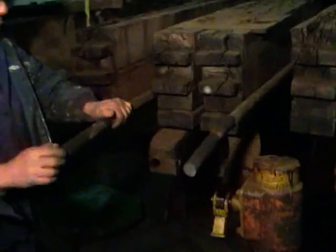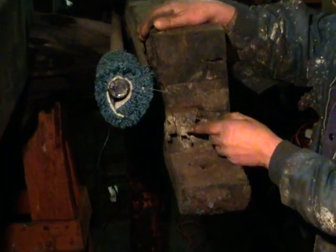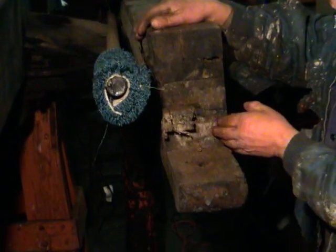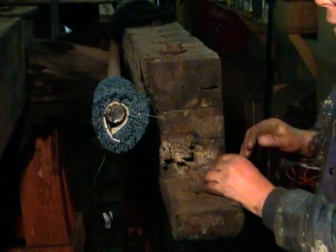These are the ends of the rods that the coupler fastened onto. Over here on this sill, we still have this little tiny bit of a tenon, which apparently was all that there was on here. We'll probably consolidate this, clean it all up, and consolidate it with some epoxy to make it stronger. I think that's all we need there.